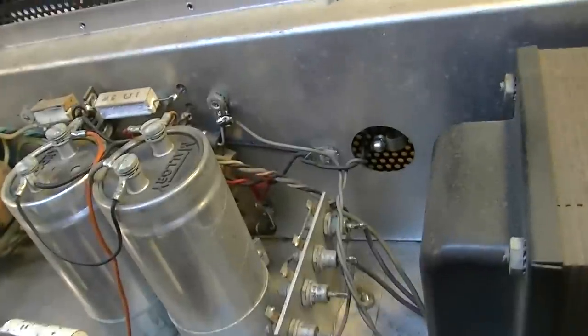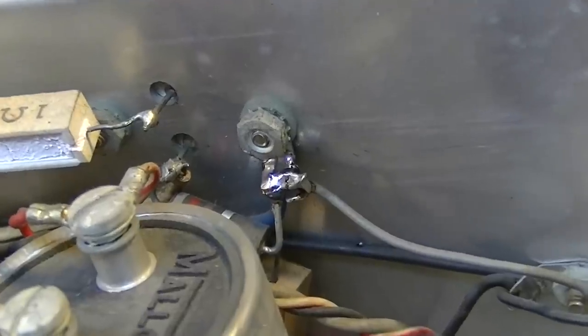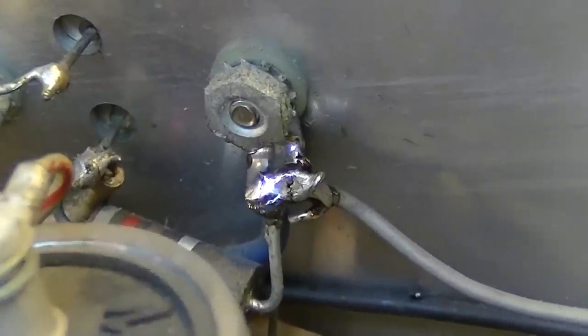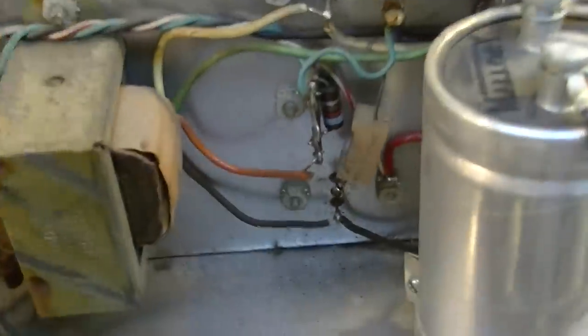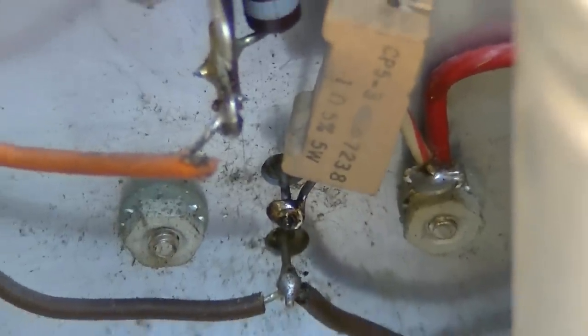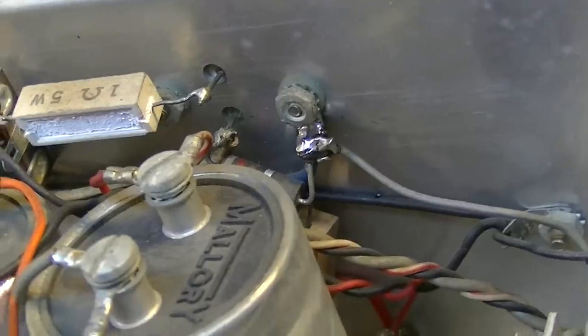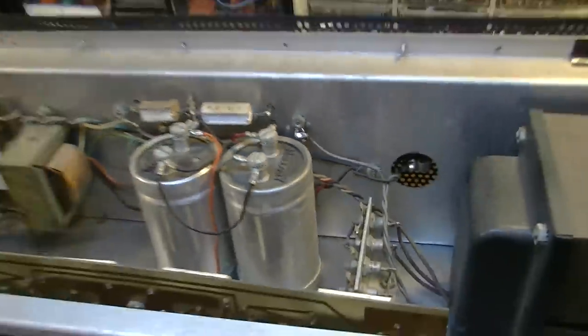Okay, so... Alright, so I soldered that resistor back on right there, and good solder joint there now, and I've got a good solder joint over here now. Both of those were, for some reason, not connected, which is rather weird. Anyway, we have those repaired, and...